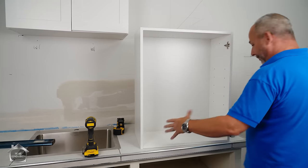Or if you don't like the location, you can also go in the middle of the door. You can go middle of the door here. I'm just a bit of a big fan of this. I always found that that's a really nice spot, right? Split the difference of the width of that shaker trim on both areas. So just by measuring corner to corner and going in the middle of it on your tape measure, it gets you dead center of both of these lines. Okay.